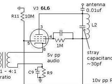Pin 5 goes down to the oscillator and that's how the carrier is created. But that transformer connected to the cathode — that is what is modulating the current going through the 6L6. And this should be the best audio quality that you could achieve with a 6L6 by modulating the cathode current.